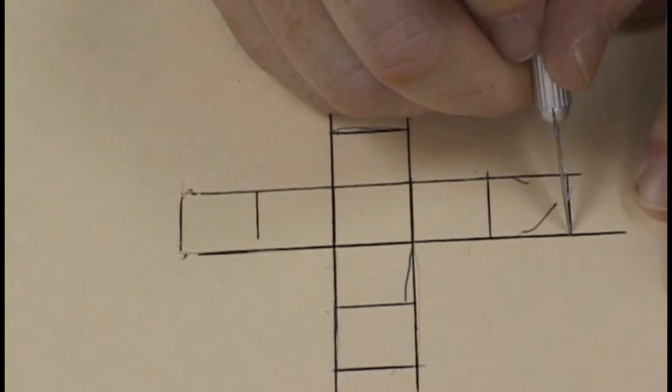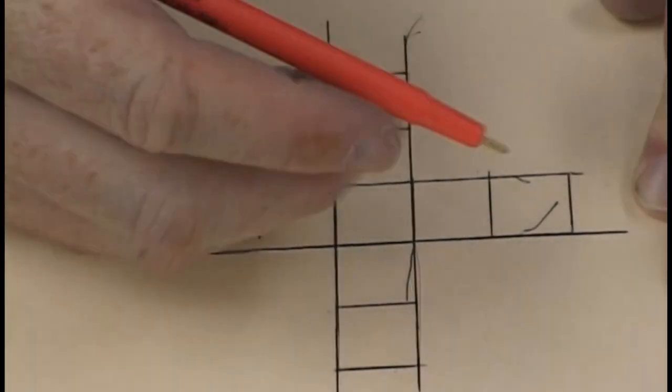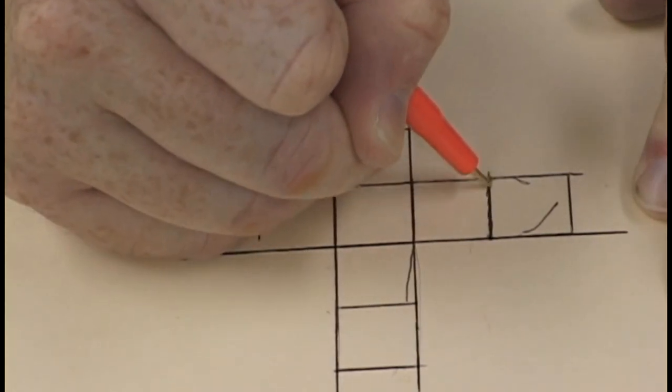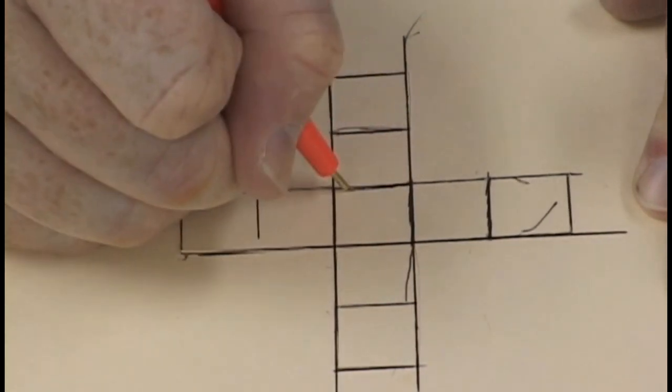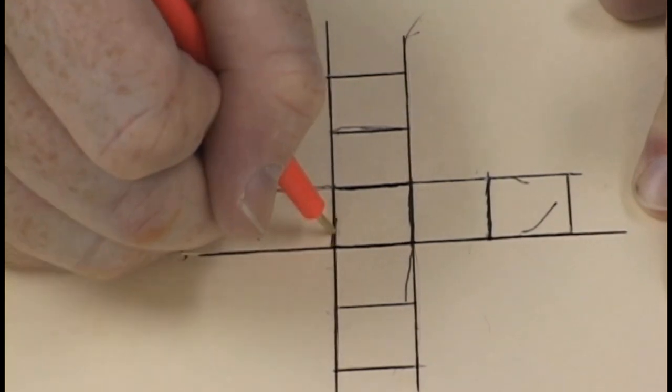If you need to use a guide when you're cutting your keys out, feel free. Whatever works best for you. Use a pen to indent the lines which will be the folding points of the key. This will make it easier for assembling of the key to the parting plane.